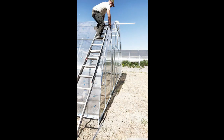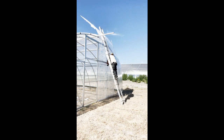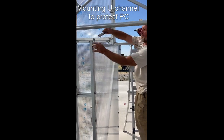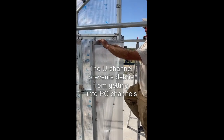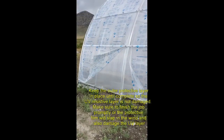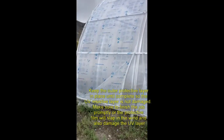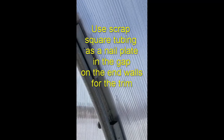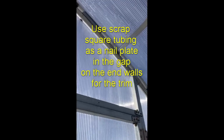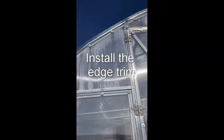After you've got all your polycarbonate on, go ahead and trim off the ends to get things ready. Mount your next panel on the ends in basically the same format as before — screw it in on all your vertical and horizontal members. U-channel protects the channels; use U-channel anywhere you have doors and vents. One lesson learned: keep the film on until you're done, but don't leave it on too long or it'll snap in the wind. When doing your trim, use pieces of scrap as spacers so you can screw the trim into — it holds much better and makes the trim really secure when done.